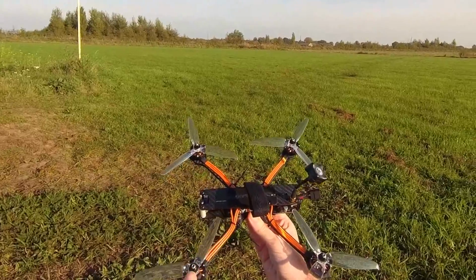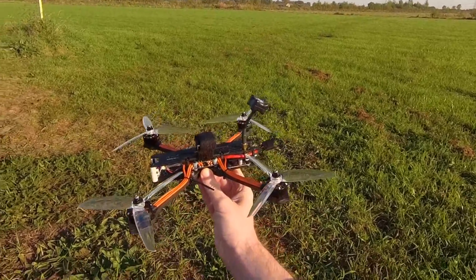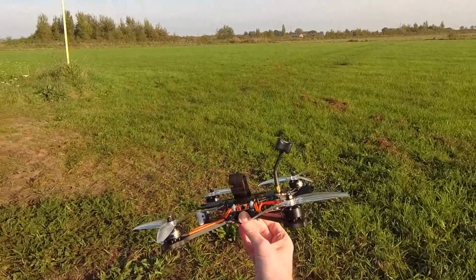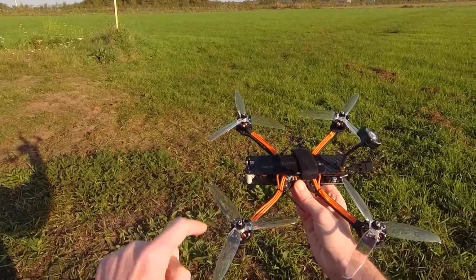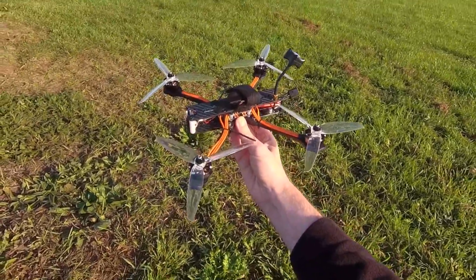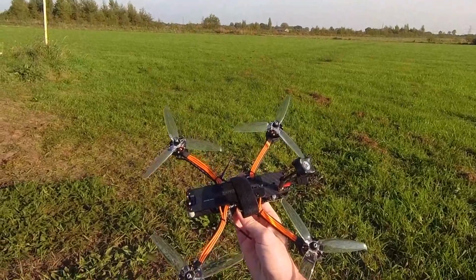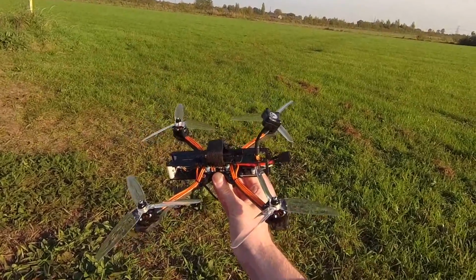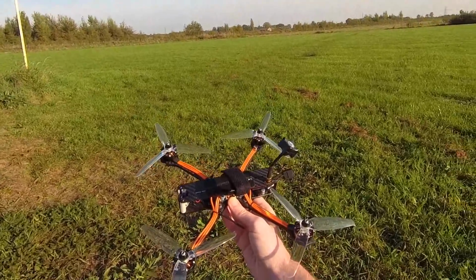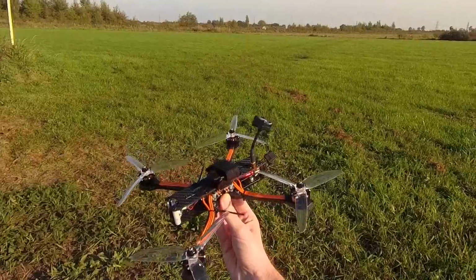However, this 6-inch version is marketed, is spec'd as being a 4S quadcopter. So what's up with that? The electronics obviously can handle 6S. So why is it a 4S version? The motors with these propellers, so the stock propellers, can't handle 6S. Well, maybe for 2 flights or 5 flights, but eventually you'll burn up the motors. I've actually spoken with Diatone about this. If you want to run this 6-inch version on 6S, you can, but you'll need to prop down. So 5-inch blades, or maybe 2 blade propellers, not on these stock propellers. So that's important to know, I think.